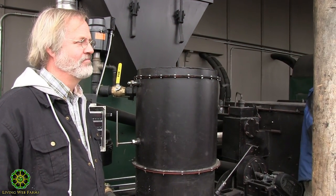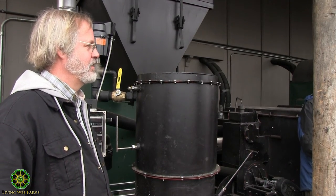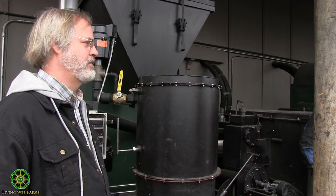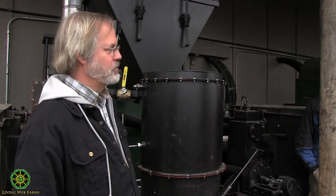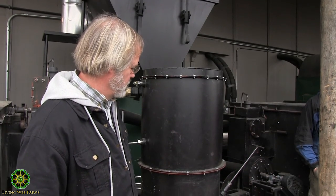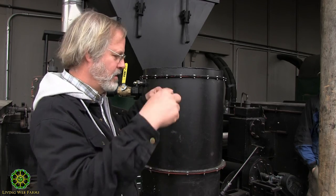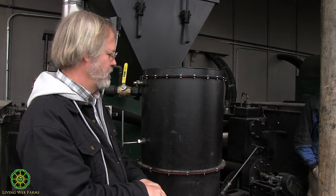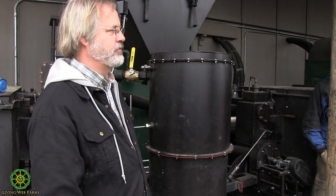Wood chips need to be as dry as we can get. Once you've got this going, they don't have to be dry at all. But you've got to start. A gasifier is sort of an upside down fire, where you're heating it at the bottom and making it volatilize, turn into gas, and then we push it down back through the coals, which helps refine that gas. And when it blows down in there, we add more air so that it turns into a flame.